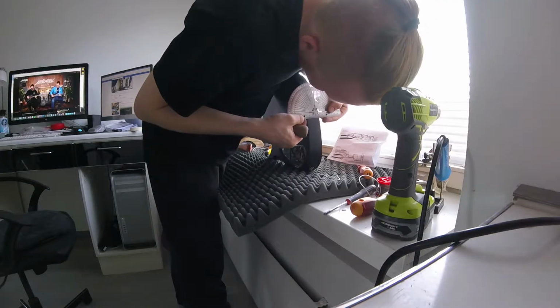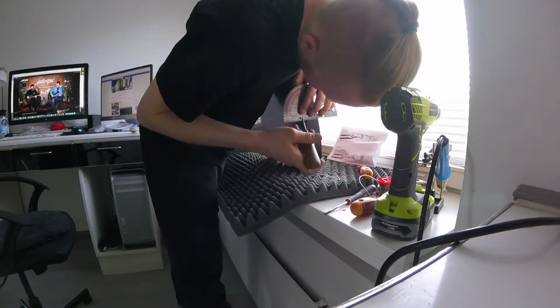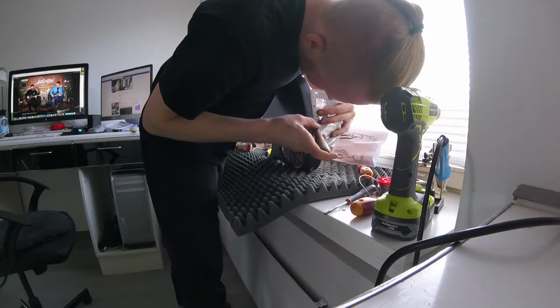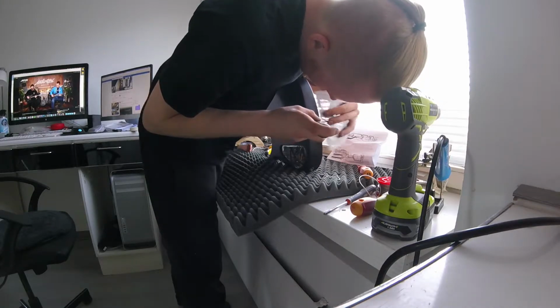Now, the thing that I always forget, strap buttons. So again, using my Incra protractor here to find my center. There we are. That's center thickness-wise, and then because it's a multi-laminate neck, I'm able to follow the middle laminate piece to find the exact middle for one of the strap buttons.